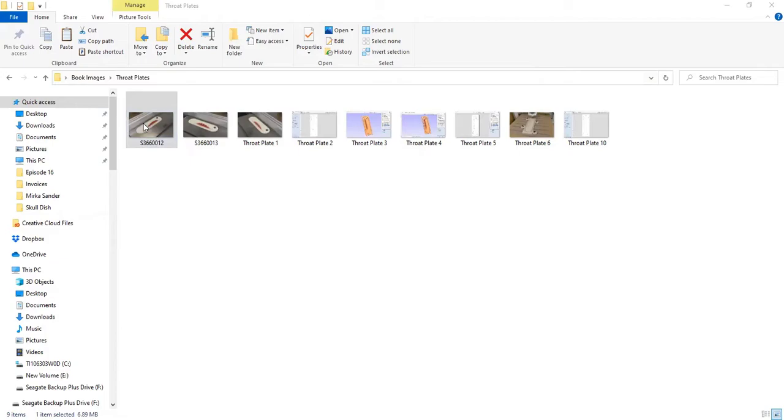So the zero clearance inserts for the table saw are a very common thing for people who have CNCs and anybody who has a table saw. CNC has nothing to do with it in and of itself. But I used to have piles of these hanging around, or I'd have to make them with multiple steps with the hand router and a saw and all the other things. And once I was able to create a program in the CNC, I basically measured and drew out the insert plate.